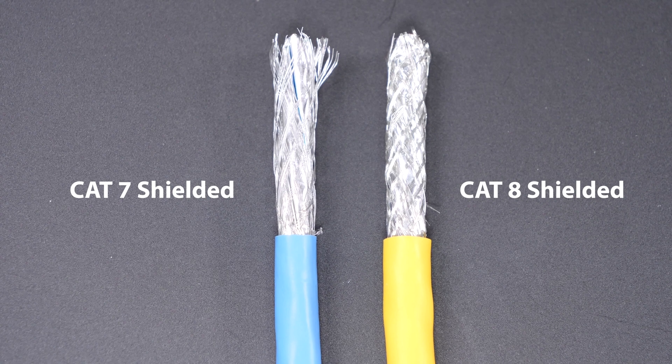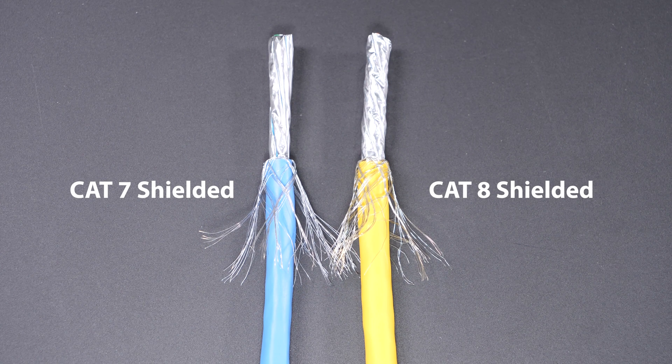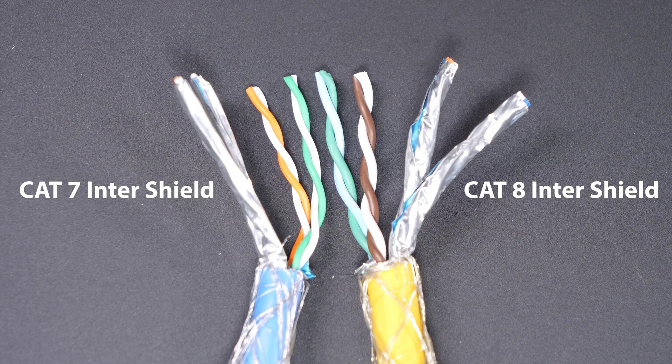Lastly let's talk about when and why to use shielded cable. There are no absolutes, but I try to follow some ground rules. If you're running wires in a harsh environment near power lines, power poles, cell transmitters, or any type of radio interference from equipment, I would suggest using shielded cables. You'll have to assess the environment and determine whether you need to spend the extra money, because shielded cable is quite a bit more expensive. Remember it won't hurt to have shielded cable even if you didn't need it, but you can run into issues using standard cable in areas with a lot of interference.